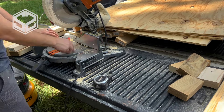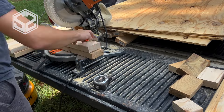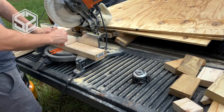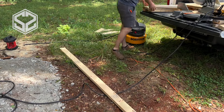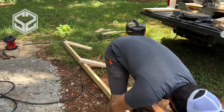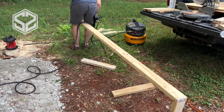It also works out well because there's less cutting if I only have to cut the plywood once. This project is also perfect for using up a bunch of scraps I had laying around from other projects, so I'm using all of my shorter pieces of 2x4s. I'm cutting those all at 21 inches, and then I'll take an 8-foot 2x4 on the front and back and nail this together, and that will create the frame for one of my shelves.